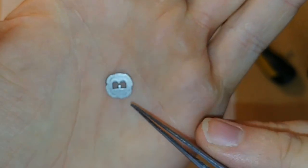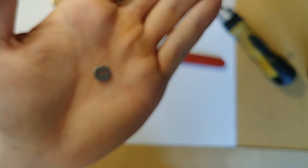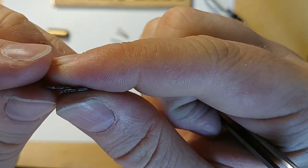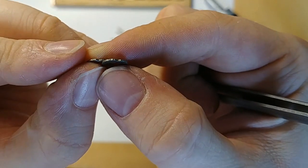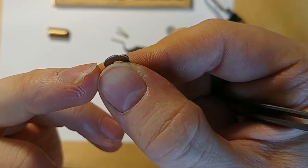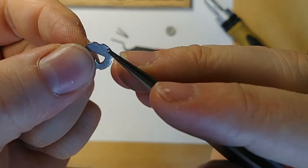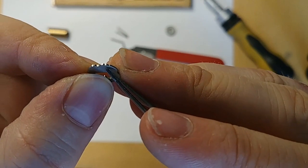the keyway. So maybe I turn off the light again. And so like this. And we can also see that we have a lot of false gates on there. So there's like three gates. 2 of them are false and 1 is true. This is what we have on each side of the disc except 1. So each sidebar we have, each metal sidebar is facing discs with false gates.